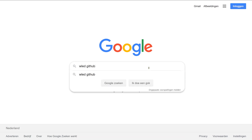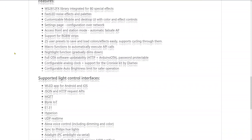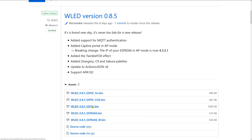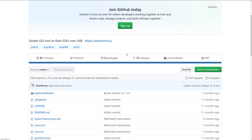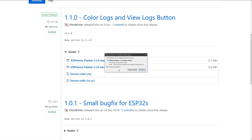To get started, let's go to the WLED GitHub page and download the latest release of WLED. The releases are pre-compiled versions where you don't have to have any knowledge of Arduino and stuff like that. We're also going to need a tool to flash our little ESP8266 or ESP32 board with — we're going to use a little tool called ESP Home Flasher. There's a GitHub page with a release on it, and we just download the right version for our operating system. I'll have all of this linked in the description below and in the written part that goes with this video on quinled.info.